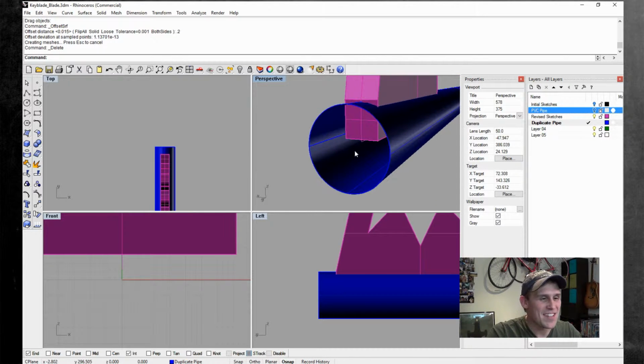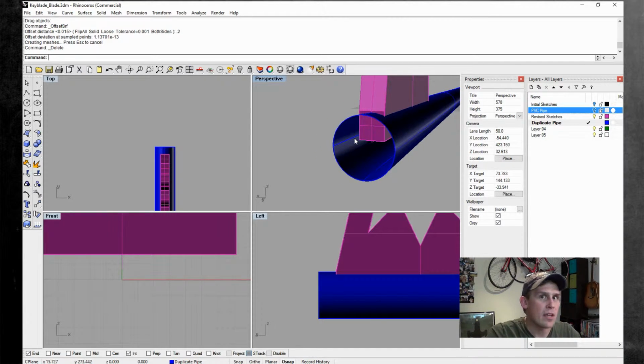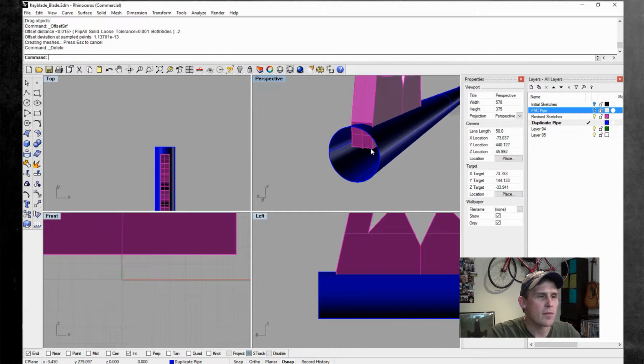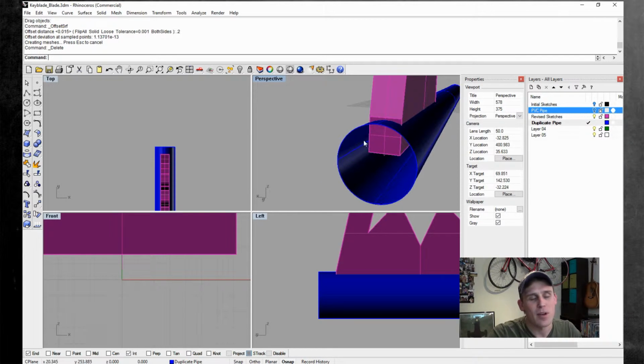There's different fits that you can achieve for multiple parts that you're 3D printing. If you want things to be snug together, you want to offset them by 0.3 millimeters. That's for an interference fit, what we call an interference fit in the business. If you want them to slide past each other, you offset them by 0.5. So since this is just rough, I just did 0.2 just to be safe.